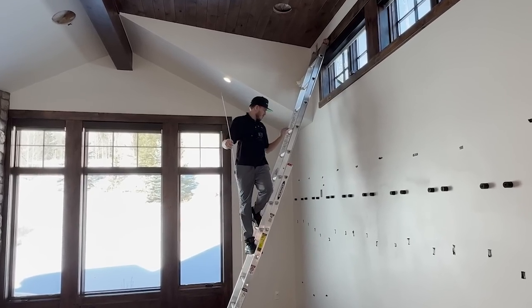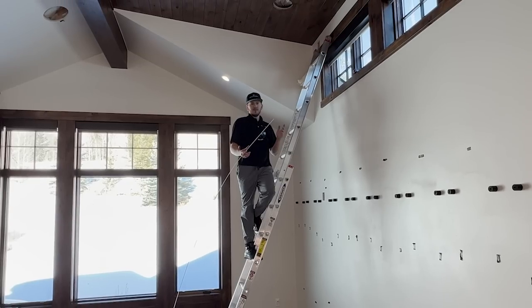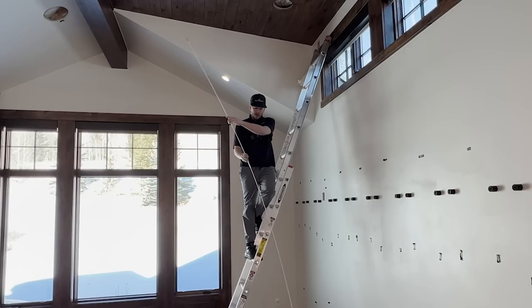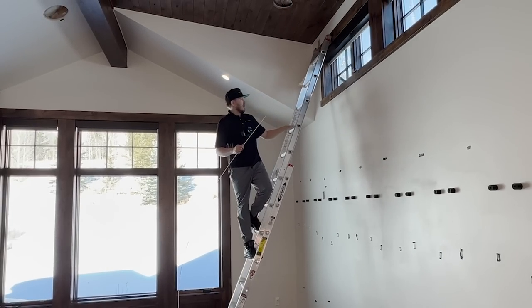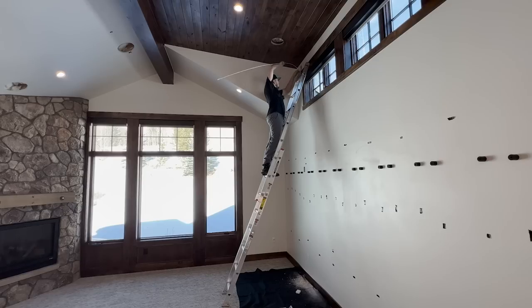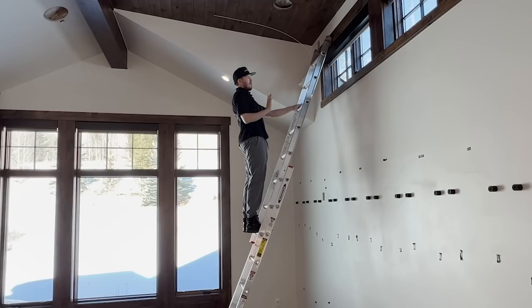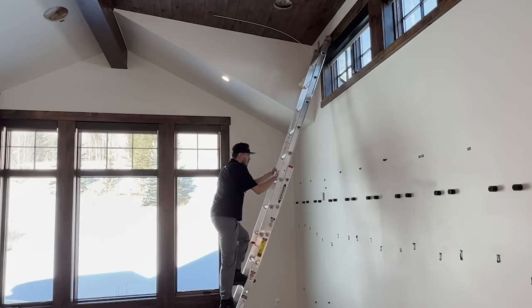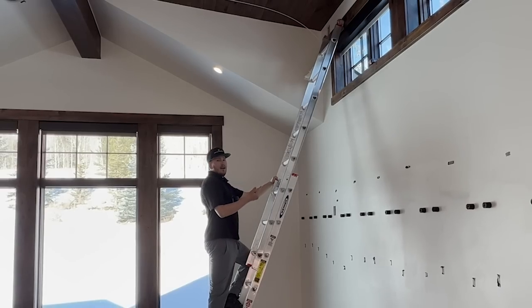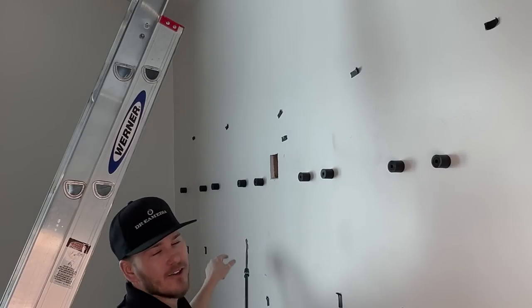Now that we've drilled through the fire break, the next step is getting my fish rod through it from my upper hole. The reason we run the fish rod first is so we know we're good to go before attaching wires. I'm dealing with a combination of spray foam insulation and standard insulation, which makes it a little more tricky. Now I have my fish rod down the wall — I try to stay closer to the inside. I drilled an inch and a quarter hole so I can fit my fingers in there and grab it.